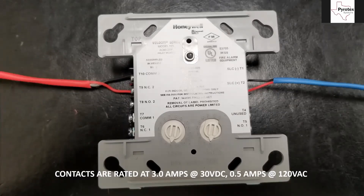We still wire common and normally closed if we're using just an addressable relay to control these dampers. The way the dampers are: we normally have them energized — we're normally allowing power to pass through them that holds them open so the building can breathe under normal conditions. When we cut power to it, the damper will close and it'll start doing its smoke control function. Since we normally want them energized, we're going to use the normally closed circuit. The rating we're more concerned with for smoke dampers is half an amp at 120 volt AC. If you've only got one or two dampers on your circuit, doing it this way is really simple, quick, and it's going to get the job done just fine.